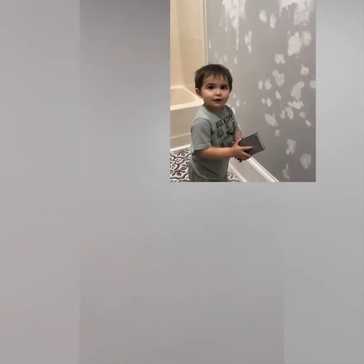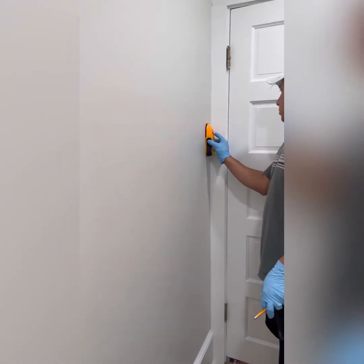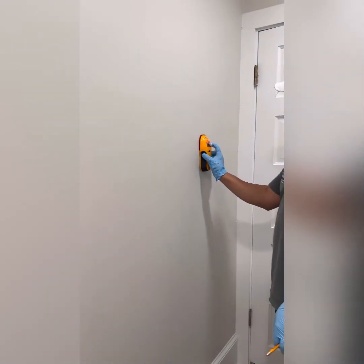So I'm going to try to cover it with some shiplap. The wall is old — it just has a lot of bumps and lumps in it. I filled so many places, as you can see in the pictures, but it's still really lumpy and bumpy. So the plan is to hang the vertical shiplap to cover that up. We're going to start by marking studs, if there even are any in here.